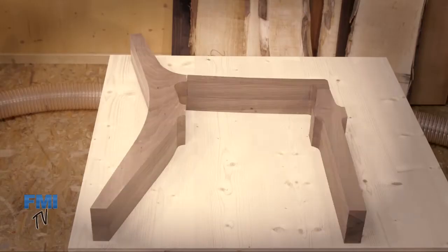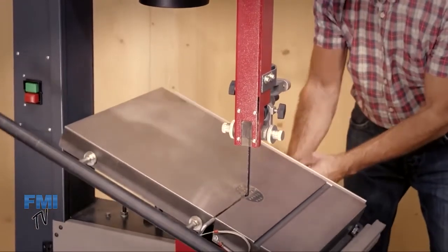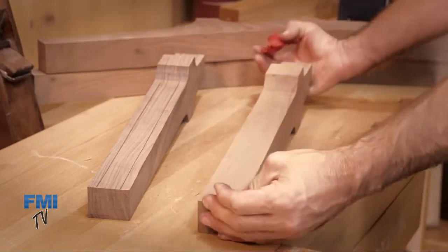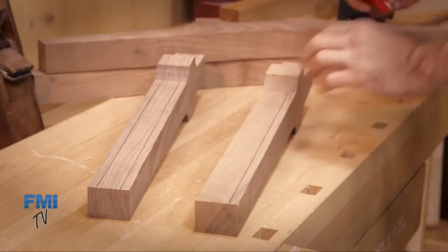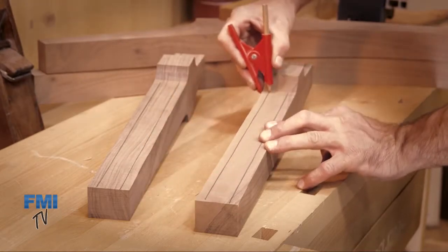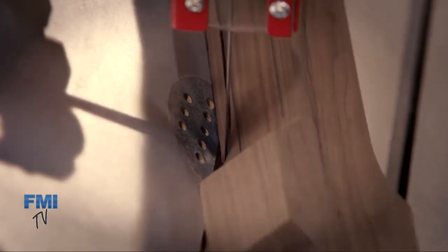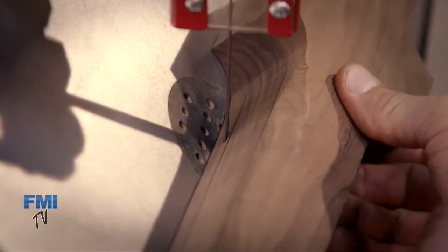As the chair legs and armrests are to be rounded off by hand, it is advisable to cut the edges at a 45 degree angle. This makes the final processing of the parts a lot easier. As the next step is carried out without the use of a fence, a little bit of intuition is required. You must pay particular attention to ensure that the edges of where the seat will join with the backrest remain straight.